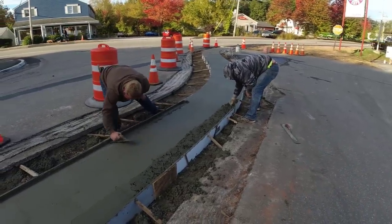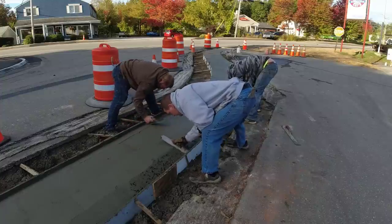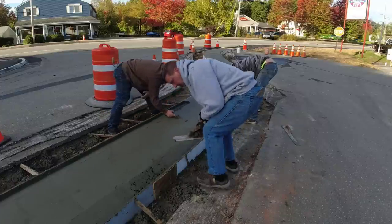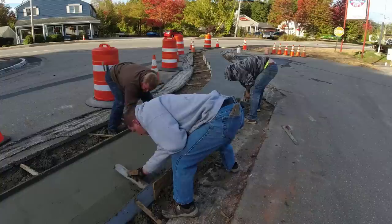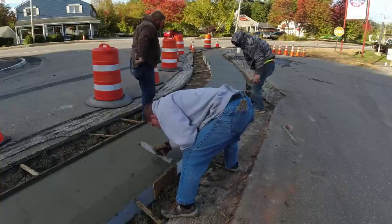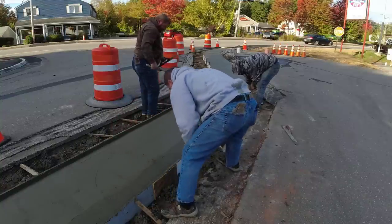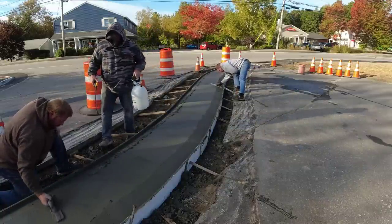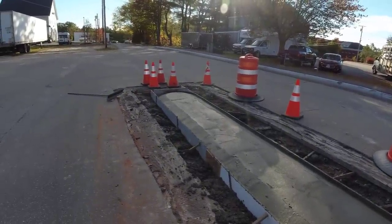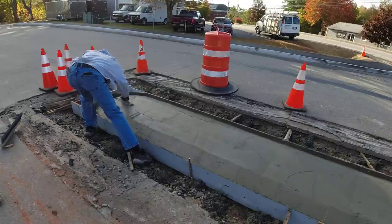The sun is starting to come up — it's still pretty early, probably about 7:30 in the morning. The concrete is firming up good because it's got a lot of cement in the 4500 PSI mix, and I believe the concrete companies were still using warm water in the mornings because it's late in the fall and the mornings are really chilly. So we'll get all that concrete pulled out of the edge, tapered, then clean it up and make it look nice and neat. There was quite a bit of work to the tapering — we pulled out quite a bit of concrete cutting it down two inches.